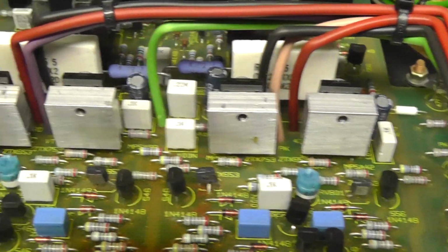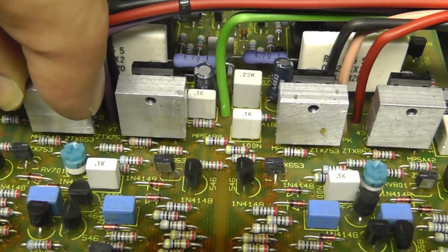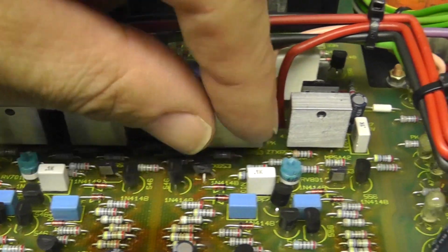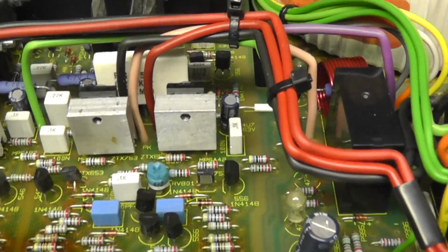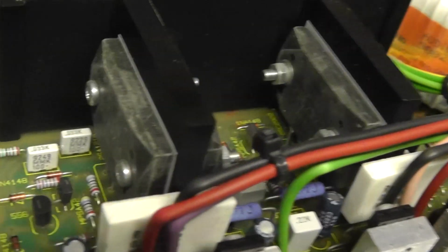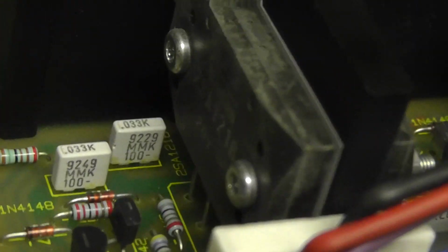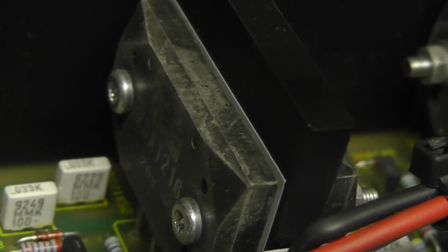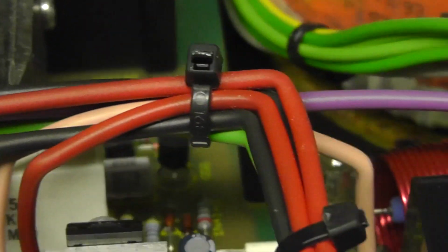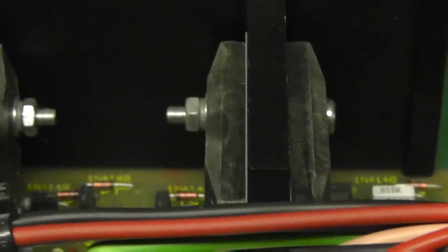These are our output drivers here. These with the heatsink bolted to them, TO220 style. They are burning hot. This is our output stage here, which uses these huge Sanken transistors, Sanken SKA 1218, capable of producing very large, high current capabilities for short periods.